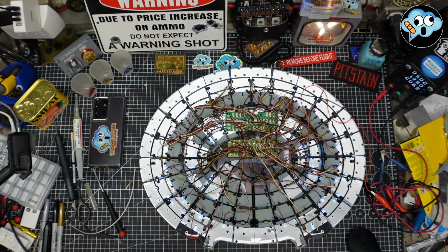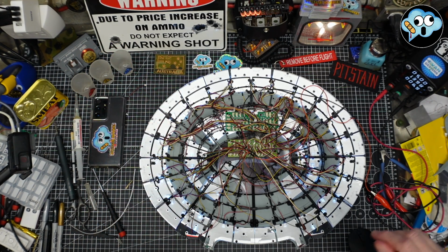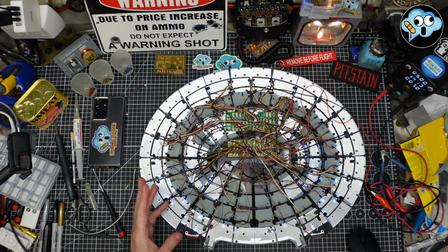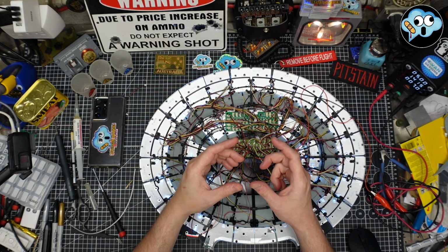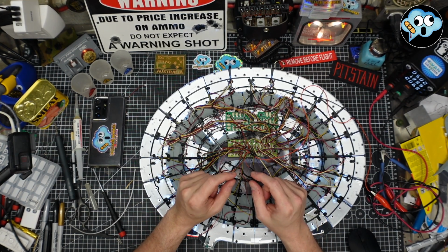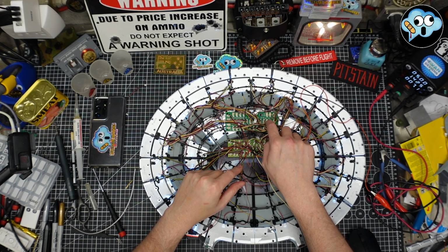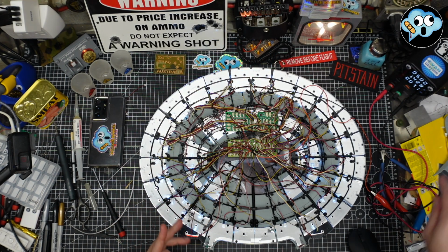Another thing that we brainstormed, me and Todd McWilliams of MyEnterpriseD.com: I might be short a couple of sockets here because we were adding a couple of things. I don't want any of my nav lights to flash. On the next section, you can kill the flashing by getting rid of that little circuit that's in the wire itself. But here you have this little chip that makes these 4 sockets flash. No matter what you plug into them, it'll blink, blink, blink, like Pac-Man on crack. Now we have 2 ways to fix that.